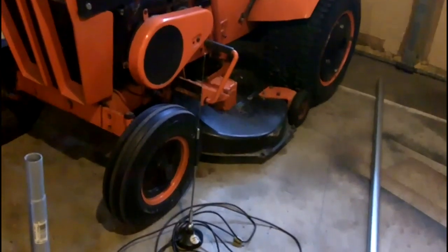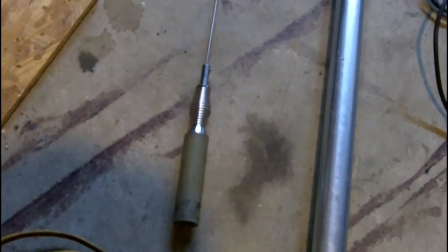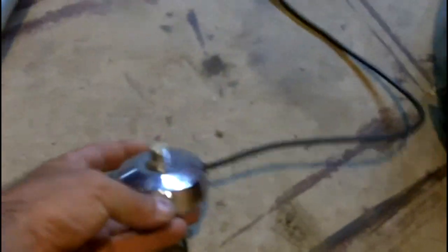I'm not going to use that one because it's just a little too small — it's only a two-footer. But I have this one, which is an Antenna Specialist from the 1970s. It's a base loaded quarter wave whip. It also has a magnetic base that goes with it. I had to put new coax on this base, so while I had it open, I added a grounding wire to it.